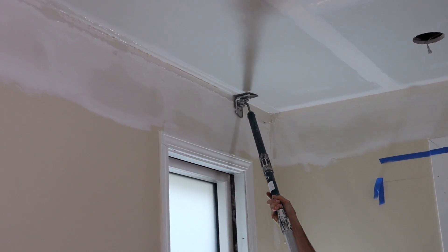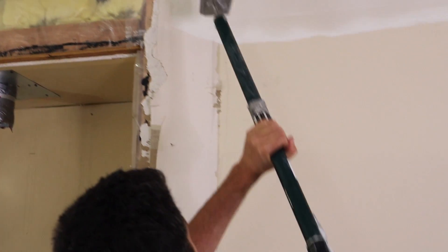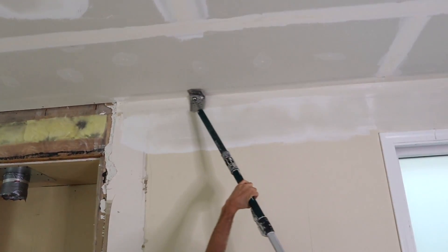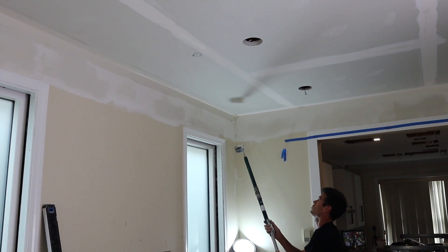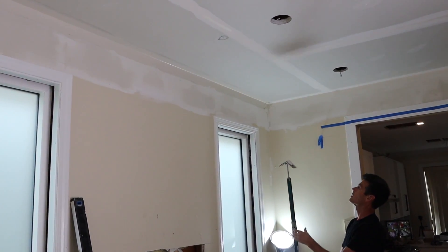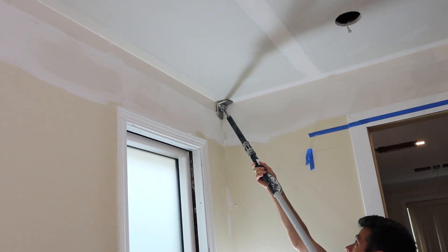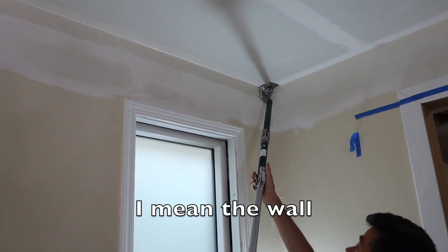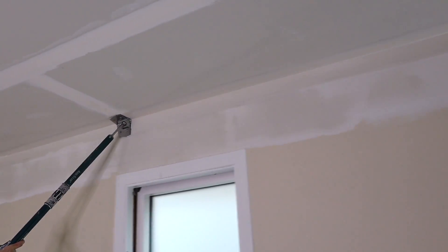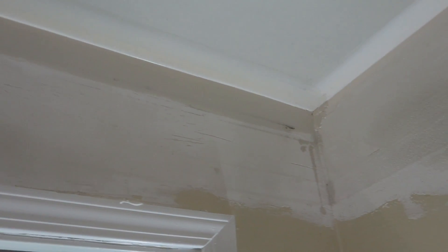So that didn't work out too nicely yet. Sometimes when the corner is not very square it doesn't work out that nice. Also, it usually needs a push down the wall to get this full of mud. So that first little bit where I had a lot of mud wasn't the end of the world, but it's dragging a lot on this concrete fill I've got on the ceiling — so it's not like fresh drywall, I've got a lot of drag here. I'm actually pretty happy with that second pass. You can see that's nice and feathered — that's actually a perfect corner.